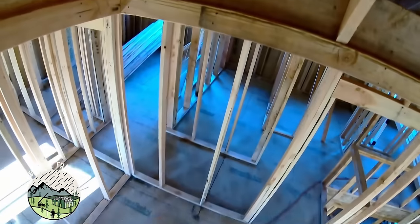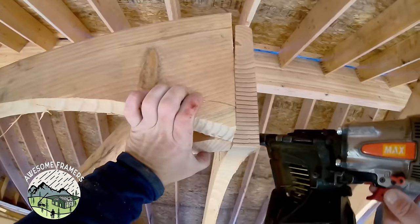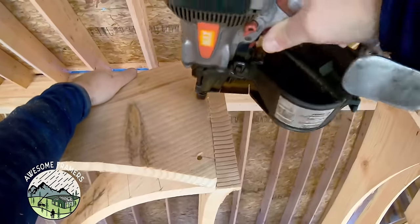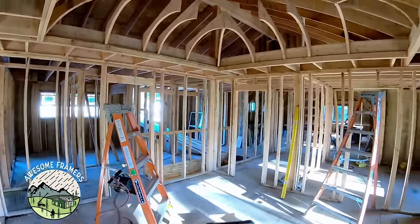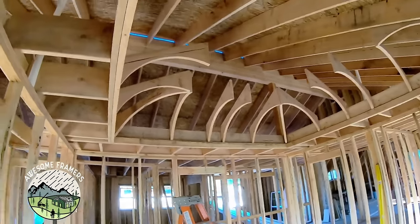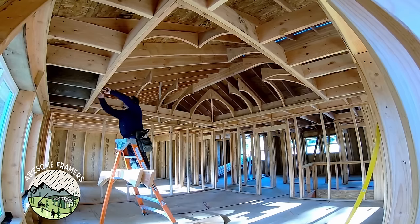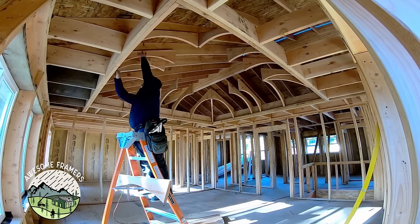You can see that's open but I'll take care of that in a second. Also, do not shoot your fingers — this gun's pretty slick, you can actually shoot a little closer to your fingers, you just have to watch the nails themselves, but it won't bounce fire or double fire. The way that trigger's set up is when you shoot once and pull the trigger first, it'll only allow you to shoot one nail — so even if you bounced over and hit your hand it would not drive another nail. There's the ceiling — I always like to install all of the rafters first and then fill in the ceiling. Trust the math, goes pretty quick. I also always cut a few extra rafters because once you've taken this much out of a 2x12, if it's cracked or falls off the ladder, then you've got to back up the brakes.